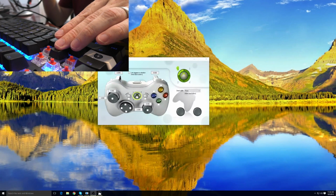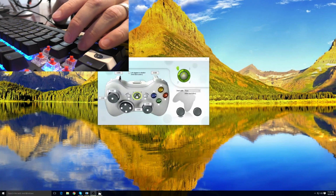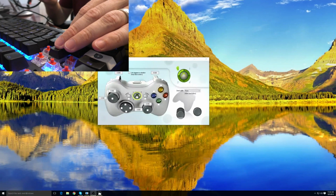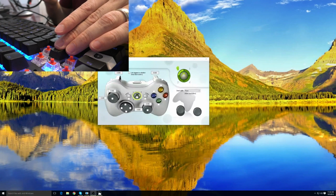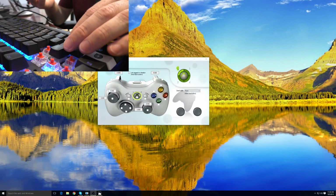You want the full key press to be analog. So I wouldn't recommend using blue or green switches. Yes, they work fine. You can see I actually am able to control it, and you actually get finer control on the release. After I've already activated the key, it responds pretty nicely all the way through. But it's that first initial press, it's pretty distracting, and it's not an ideal solution.